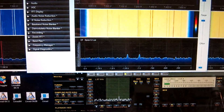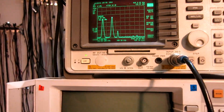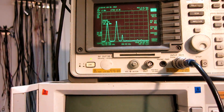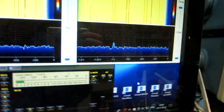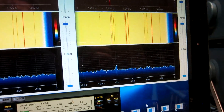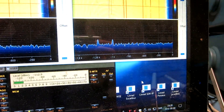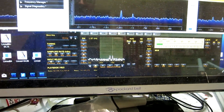With the 1.7 firmware without preselector, I can get a little bit more signal — minus 30 dBm. But one of the signals is now outside the preselector filter, so I don't see anything in the preselector unit and I have to get more signal. The level is minus 23 dBm, and that is the same that I see with the preselector.